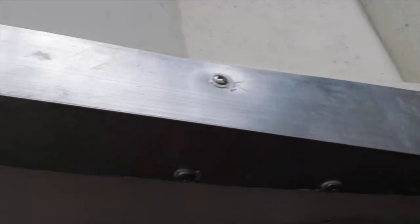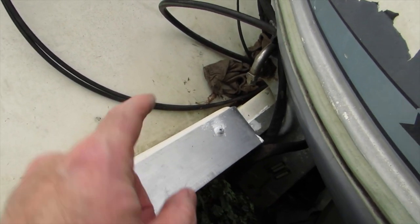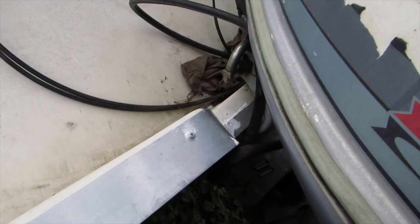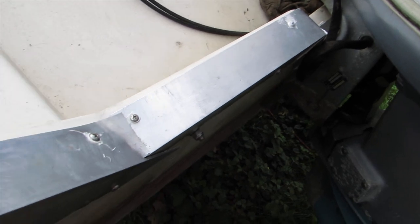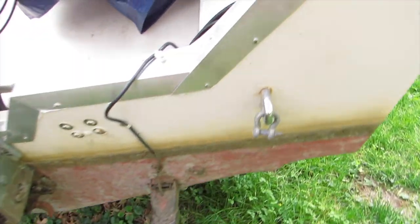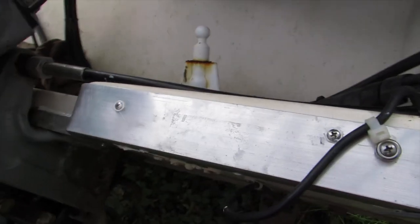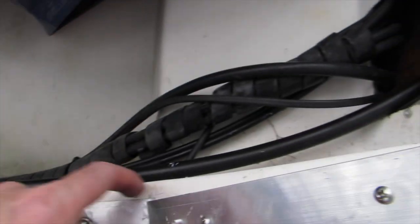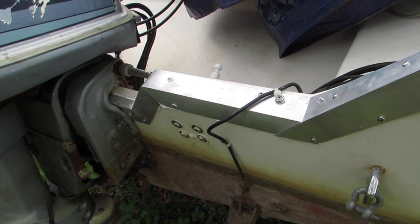Here's the other side. Compared to what we had before, the old cap didn't even cover half of the top of the transom — that seam is where a lot of water came in. So I'm covering more of it now, with new sealant underneath. I may still even wrap this side on the top here — I haven't decided yet. But I've run out of 4200 and I'm getting tired. I'll probably get another tube of 4200 and at the very least seal up this outside edge — just run a bead along all the edges. And we'll take it from there.